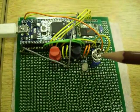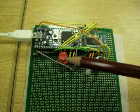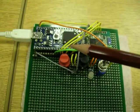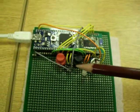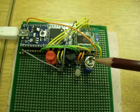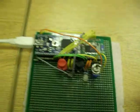By default you can use two baud rates, 9600 or 115200. If you use master mode you can set other baud rates by AT commands, and after reset you can use those baud rates. This pin control will not affect anything until you reset the whole settings to default. Then this switch will operate, so whatever you have set up will be used. So let me start the demo.